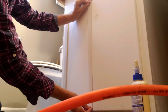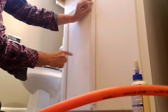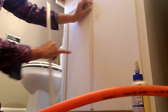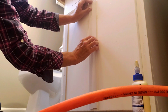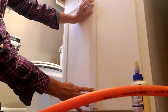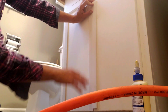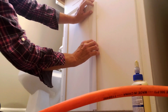So I'm not going to tack this one in place just yet. Now you can, in this case, my two cabinet doors meet. And they're a little old and sticky. So, if you want to leave out this centerpiece, you can. I find it looks more finished having it in it. And since this is basically the first thing that people see when they walk into the bathroom, I want this one finished and complete. The one behind me, I may not, just because this is $1.14 a foot if it is unprimed. And if it's primed, you're actually getting a lower grade piece that may have been filled with wood filler, but they primed it for you and it's like 84 cents. So it helps speed up the process of getting this done.